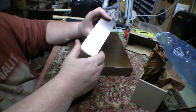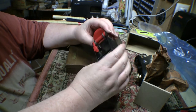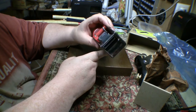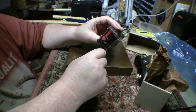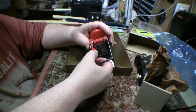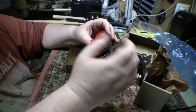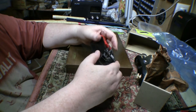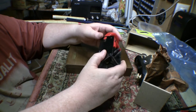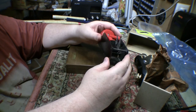Incidentally, there are completely different approaches to how you hand plane. This is actually a Swiss plane - a completely different idea. The blade in this thing is like a razor blade and it's disposable. The body of the plane is literally just a U-piece of steel, good quality, all nicely leveled and squared. You adjust how much the blade protrudes by pushing a lever up and down, and there's a little gadget you just flip up to take out the blade holder and replace the blades - so you never have to do sharpening. This has served me well over the years. I've only changed the blade maybe three times, and for light work and small work it's pretty convenient. Although I expect the Stanley will probably take over now.